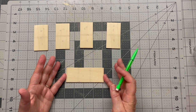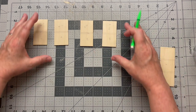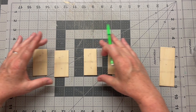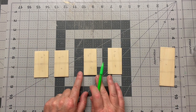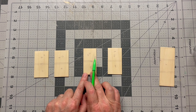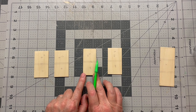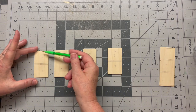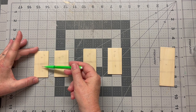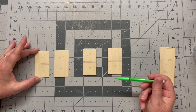The total length of that piece is 101mm and each of the smaller spaces are 3mm wide. You'll notice that piece C is a little bit narrower — there's a reason for that. I need to accommodate for the width of the door when it's closed. I'll explain more about that when we get to that point, but trust that it is supposed to be a little bit narrow.